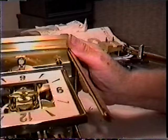And this is the suspension. This is the suspension spring I showed you. It's the roller and the fork up at the top. Right in here, comes on down. The suspension spring comes down through the bottom, hooked in here like we took it apart. And these are the two discs that I told you about. You have to have equal distance between these two discs in the locking plate, so that it doesn't rub against either one of them. The distance between the two discs should be equal, so that it can be free to run.